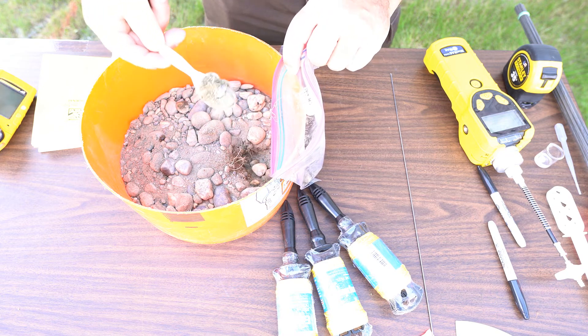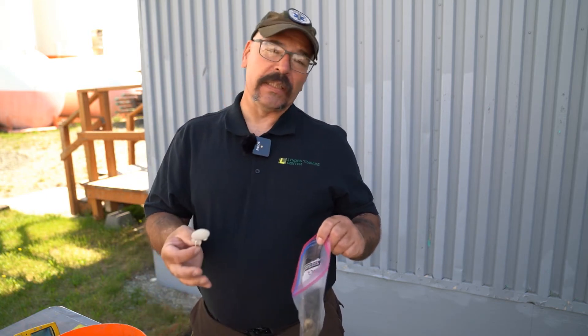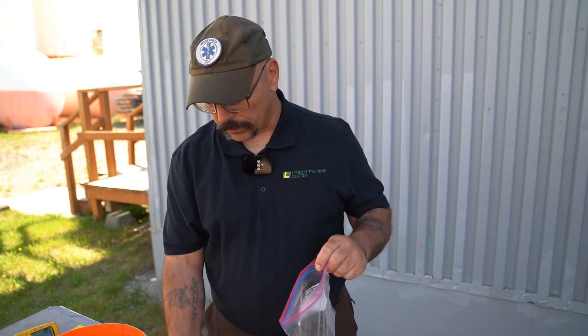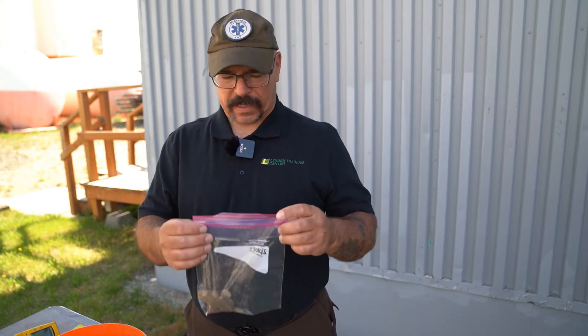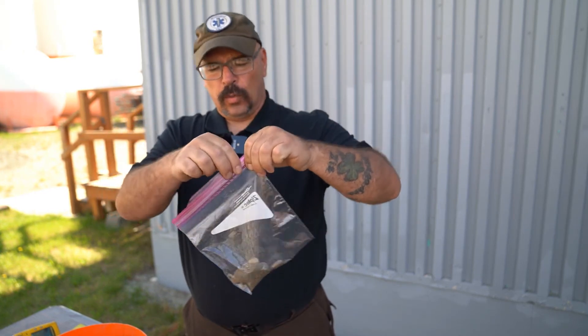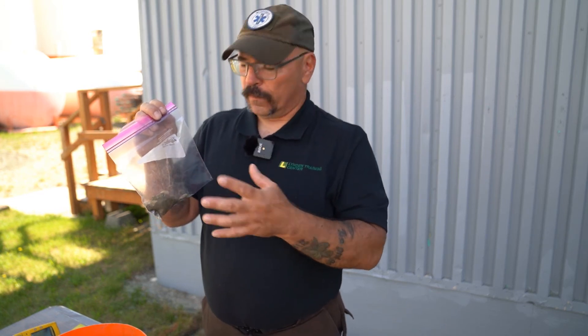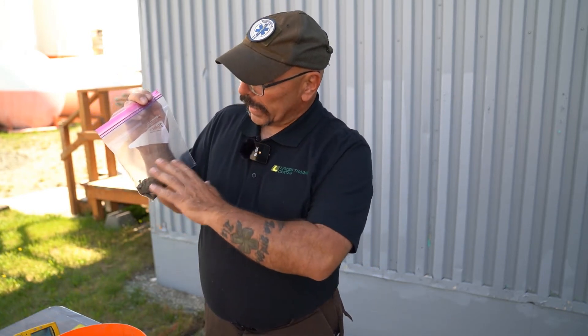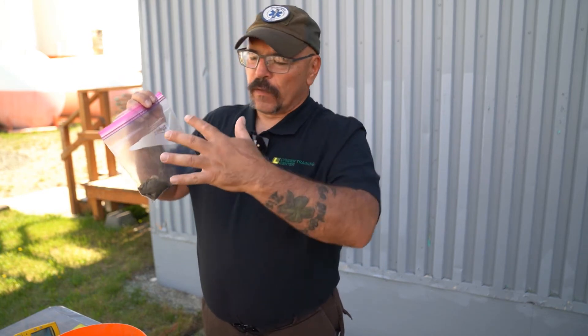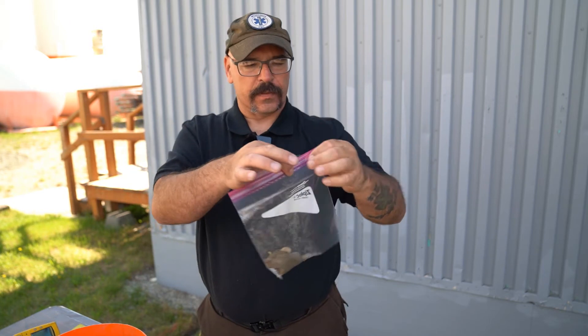The key to taking a headspace sample is to try to take the same amount of soil for all samples — I go with about four spoonfuls. Then I reduce as much air as I can while leaving a consistent headspace. Your readings need to be comparable sample to sample, capturing a definitive amount of vapors based on a consistent volume of dirt. If some bags are fluffy with a larger headspace and others are flat, you won't get consistent readings. I just take a relaxed approach, leaving a consistent amount of air.